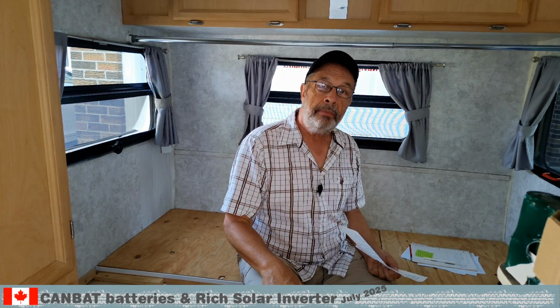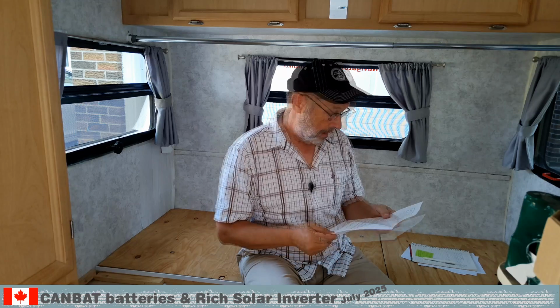Another problem is the idle shut-off time. We plugged in the fridge overnight and in the morning it was off. We found out that after 1 hour of idle, the inverter just turned off. So the fridge was not really a fridge anymore in the morning.